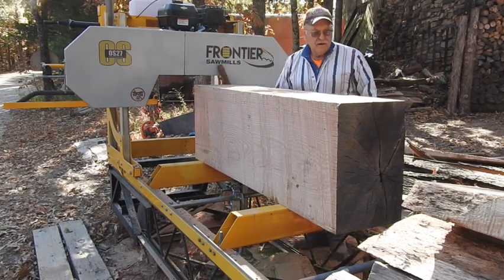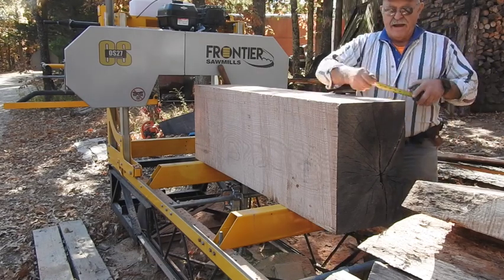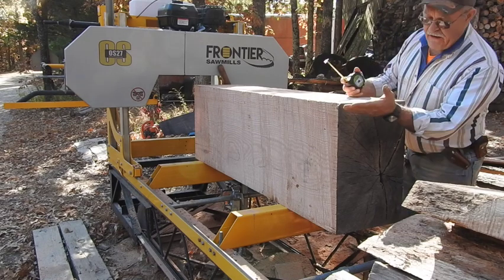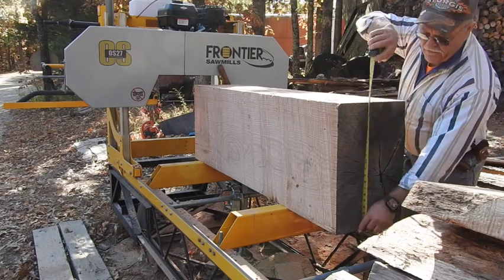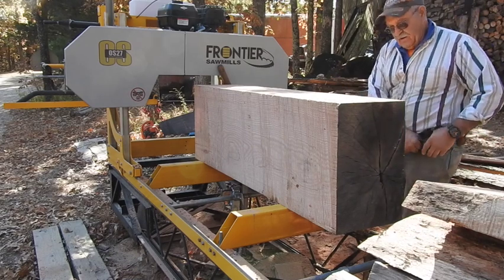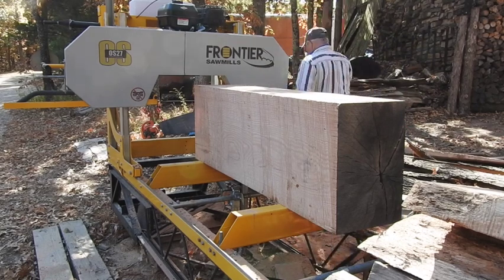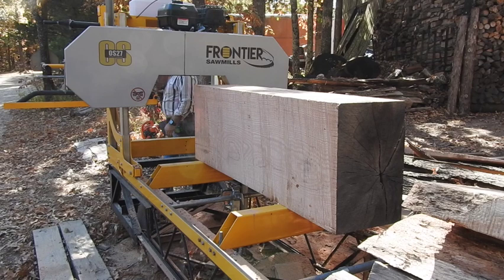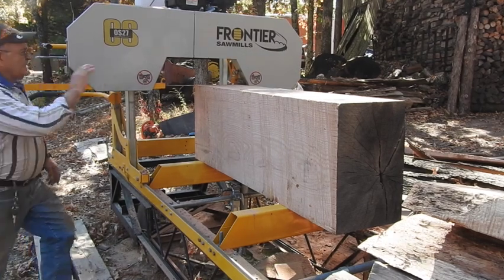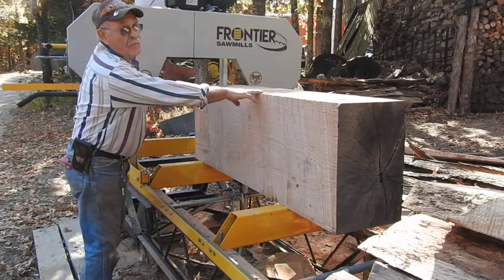You're going to slice them — two inches? Yeah, I'll make two inches. These will be two by fourteens. And if we take two off of here, it's going to leave us roughly 17 inch left by 14. We don't know what we're going to see when we get a little further, so we're hoping to get some good slabs off this. I'm going to take a little off the top — it's a little washboardy — to give us a more square surface and get rid of those chainsaw mill marks.